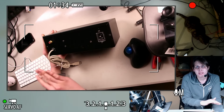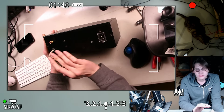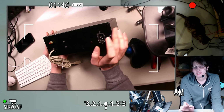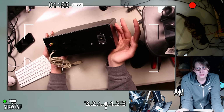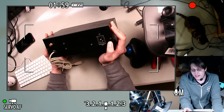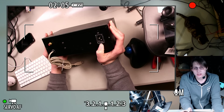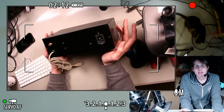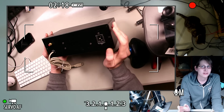So with USB, it starts with low speed, which is the 1.5 megabit standard. That was what they came out with at the very beginning of USB to complement their 12 megabit full speed standard. And the logic behind that was 12 megabits is what they actually wanted, because that's what most higher end peripherals could handle. That's what you needed for stuff like serial ports and flash drives of the era. But it was also relatively expensive to actually implement the silicon for 12 megabit transceivers at the time, and relatively power hungry. So the 1.5 megabit standard was actually like everything bending over backwards to support these very slow transceivers and very slow devices.